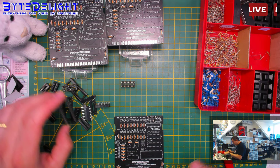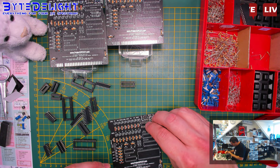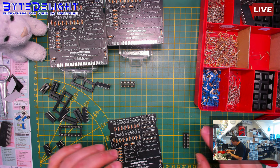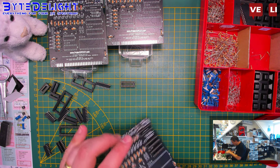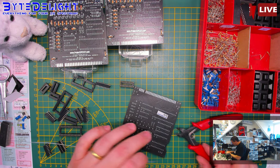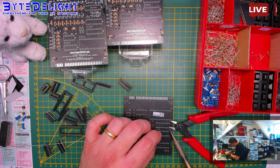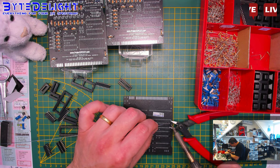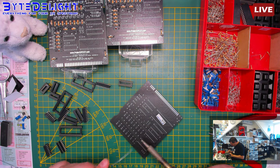Okay, the way I put in the sockets is, I should start with the 20 pin, and I have a reason for that. I can do it the hard way, I can do it the easy way, and I always like doing it the easy way. So, now if I turn this around properly, nothing will happen. Look, I can just put it around without any problem. The only thing I tend to do is put something on the end here to keep it horizontal, just for a bit of help. And that's all. Because I'm lazy. So now we do speed soldering.